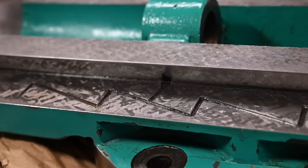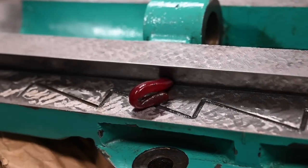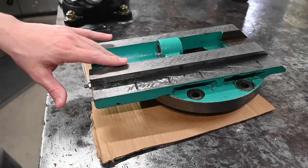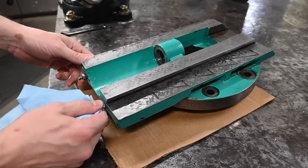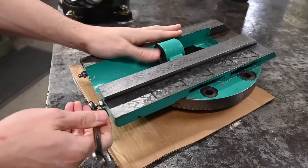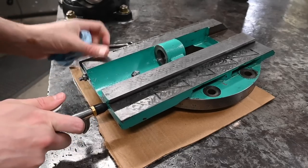All right, let's give this a shot just to see where the stuff goes. Oh, well. That immediately squirts out there and also comes through the central bearing here. Now that we've got all the parts and pieces disassembled, cleaned up, and ready to go back in, I want to get the rest of the grease out of this thing. What we'll start with is trying some air. If we can get most of the chunks out this way, then when we start flushing it with oil, it won't be quite as big of a mess. That's my hope anyway.